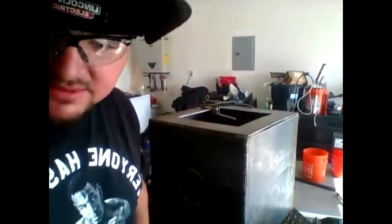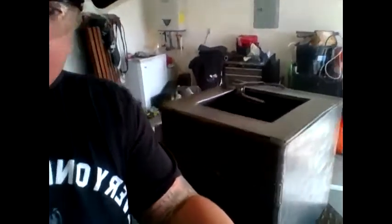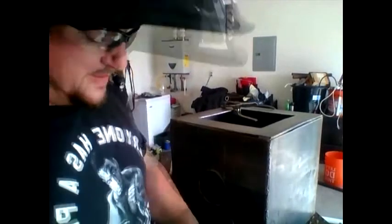All right, you might not have been able to see the weld process, but you can see the before and after, right? See that? You can close up a gap. Just go a little bit wider, a little bit slower. You're gonna see a bigger puddle. Don't get scared. Puddle likes to stay where the heat is. All right.